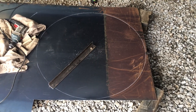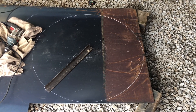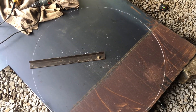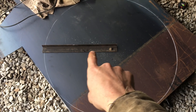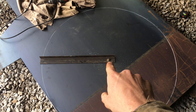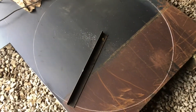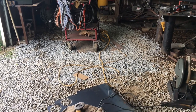I'm making this 38-inch diameter cover for a fire pit and I'm going to make this by plasma cutting out a circle, but I'm going to have to do this by hand. I know my radius is 19 inches for a 38-inch diameter, so I drilled a hole and put a bolt in here so I'm able to spin around. I'm going to fire up the plasma cutter and show everyone how this is done.